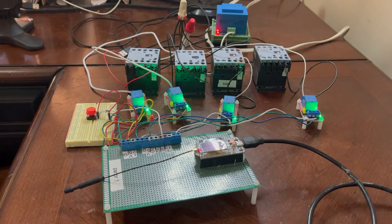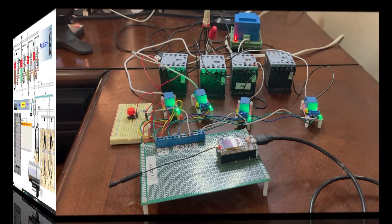For this application, I'm using four IEC contactors with 24-volt AC coils coming off the step-down transformer. These aren't starters, so I'm using this little red button shown here to simulate a fault on the rinse process pump only. I don't have chemical tanks in my garage, so to simulate the tank levels and temperatures, I'm using random number generator routines in the node program to publish those variables.